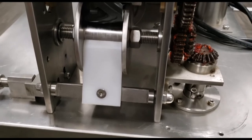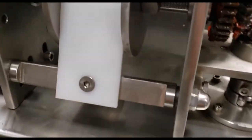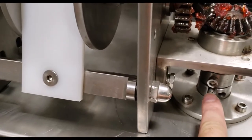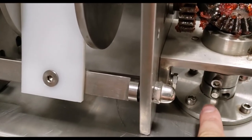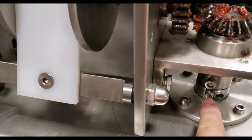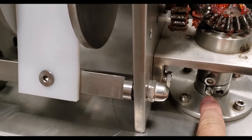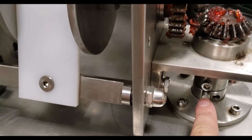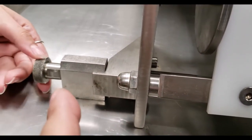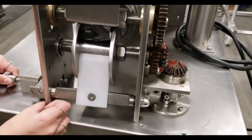When lifting and removing the mold, you need to make sure that this pin here is aligned, ready for it to be lifted up. Otherwise, when the machine is working, this pin might be in the lock position. So you need to make sure it's here in order to release and remove the mold. As well, you will need to unlock the latch to access the mold in order to lift.